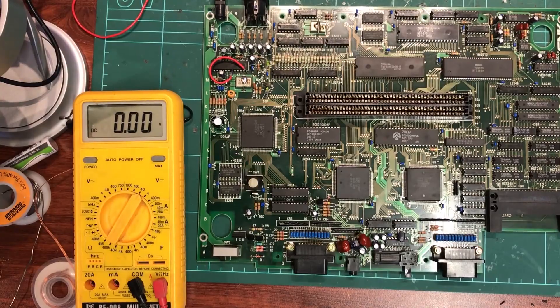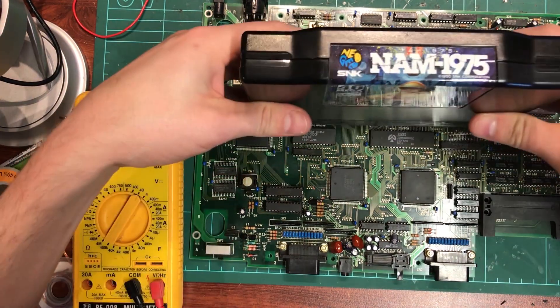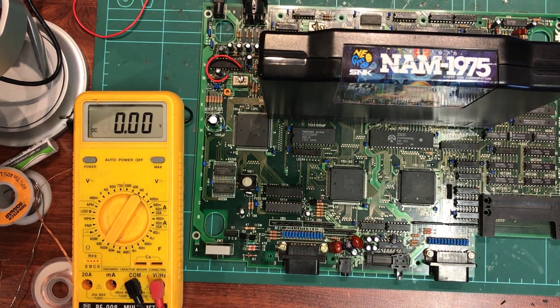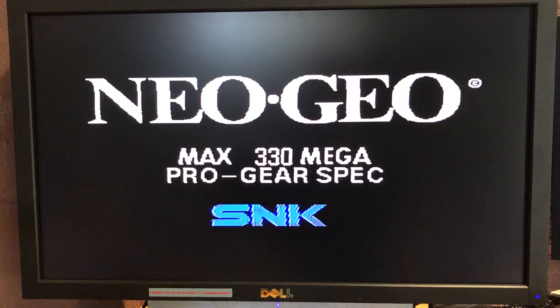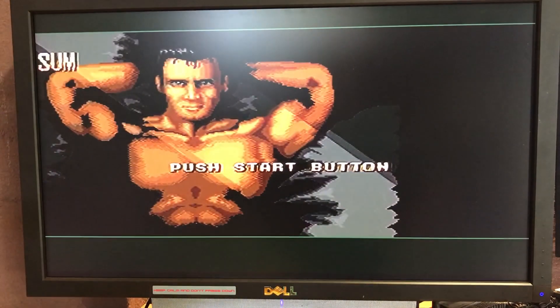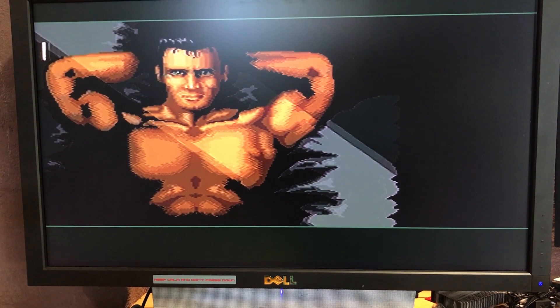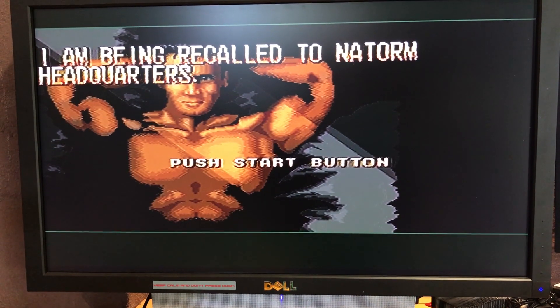There we go - we've got a solid blue screen. Solid blue means it's working - everything's perfect. I'm going to get straight on with that. Put the game in, fire it up again, and let's see if we get the background sprites. We've still got a little bit of jitter in the colors and fonts. Now we've got background! So we're going to have to look at capacitors next to address all that jitter - I'd say there's some AC ripple in the voltage lines.